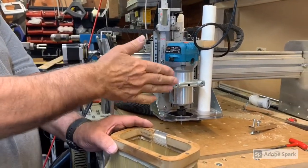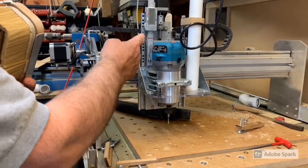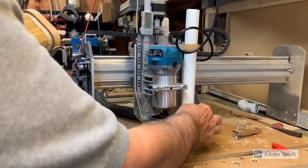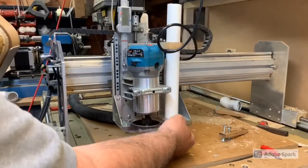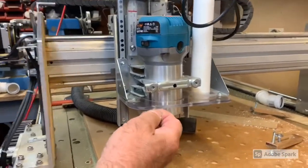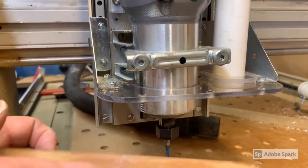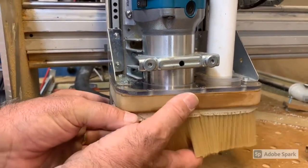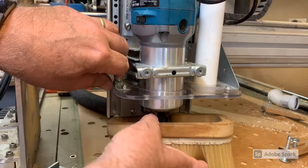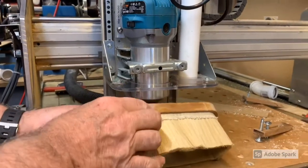This router actually sits close to this because I want the center to be very close to the center of the rails. I didn't want to pack it out any further because you'll get some twist. This mechanism is actually mounted on two drawer slides from Screwfix in the UK, and these are just corner brackets. This is a piece of polypropylene waste pipe and the hole is just fitted directly into there. This is all held on with magnets — these magnets are six millimeter and they protrude underneath about a millimeter, and that gives me the registration onto these magnets in here. When this goes in, this pushes up here and this unit clips on — it's actually really quite difficult to take off.